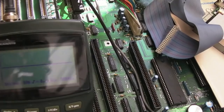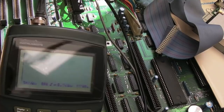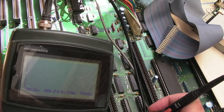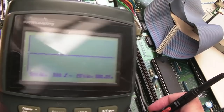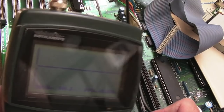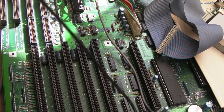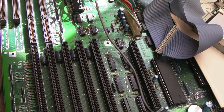We must have one connection to the RTC chip that's not there. I've been trying to scope the clock. I can see pulses on some pins, but if I go to the clock pin it's just got a little bit of jitter. Probing the crystal pins themselves — there's just nothing, just a little bit of noise. I think the crystal's gone. I can't be 100% sure with this scope, but it's never let me down before. It's only in the region of 32.768 kHz — so that must be the issue.